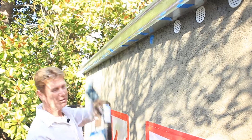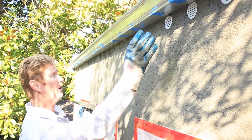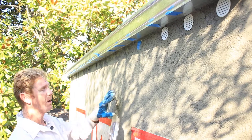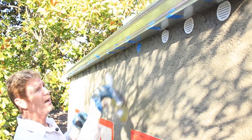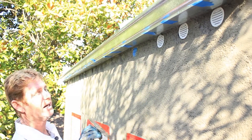I'm not showing you how to apply stucco on this particular video — I'm just showing you how to get in here and float all this. This is a float finish, meaning we use a lot of water in our float. First I was going between it, but I couldn't get it underneath this gutter, so I put it in hard and forced it in there.